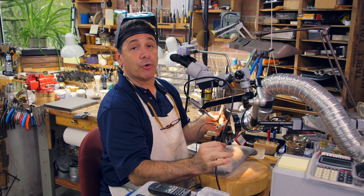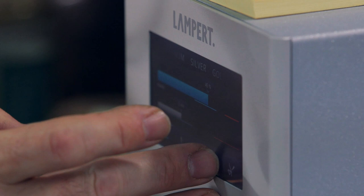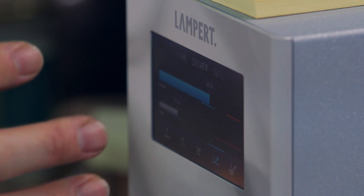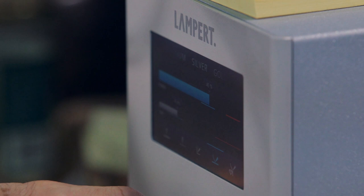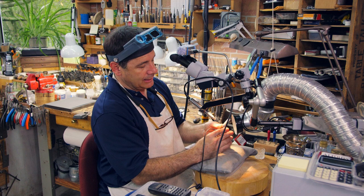I'm going to program this for silver. It has various settings for gold, platinum, palladium, and so on. I'm going to choose the welding wire setting — I'll just click that and it automatically sets itself. It's just a basic setting on the power and the milliseconds, but since this is a very thin piece, I'm going to dial the power back quite a bit and the milliseconds back as well, just so I don't end up burning a hole through this piece. I've got a nice sharp electrode so it should give me a very, very nice weld.